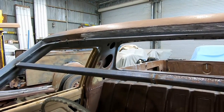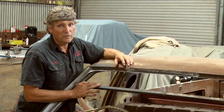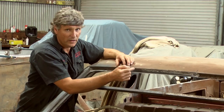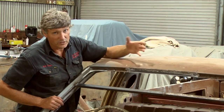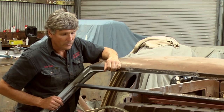And it's all straightforward stuff. Like I say, follow the rules, take your time, and get everything fitting nice before you start welding. And you can actually get there and you can do proper welds, none of this little tack here and a tack there and a tack there, and try and pile them up on top of each other until you've sort of got a weld. We actually welded it with proper weld, and it finished off nicely, ground up great.